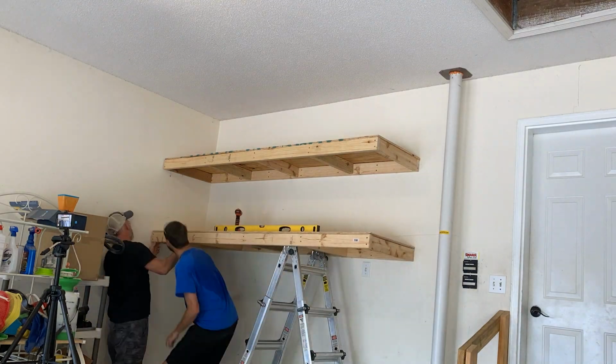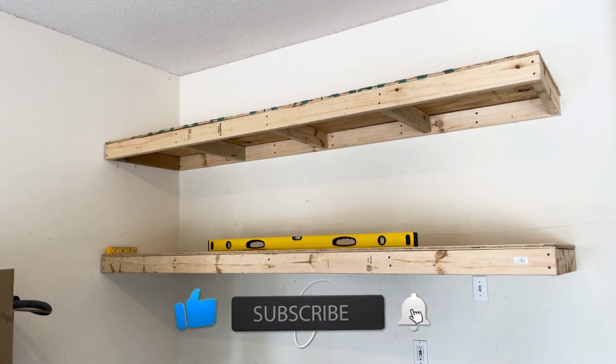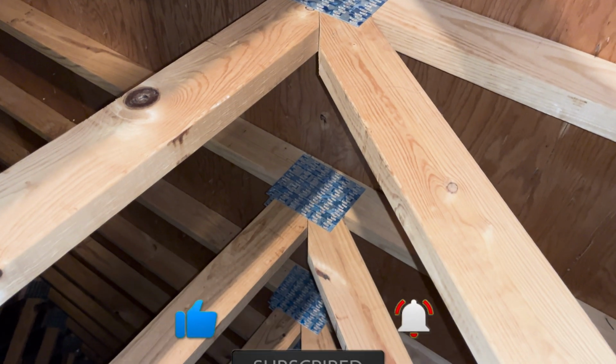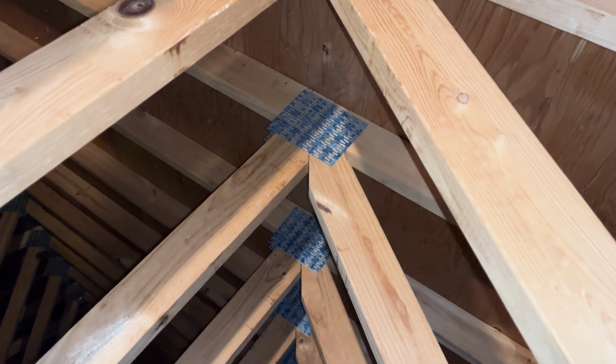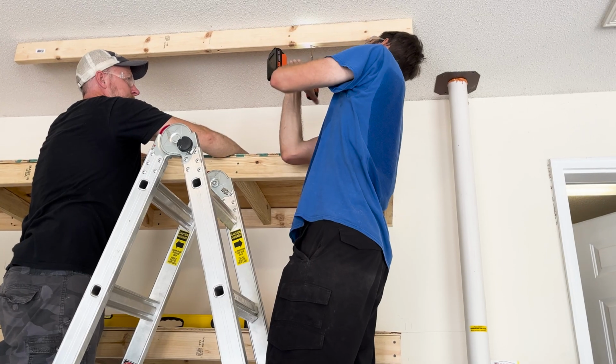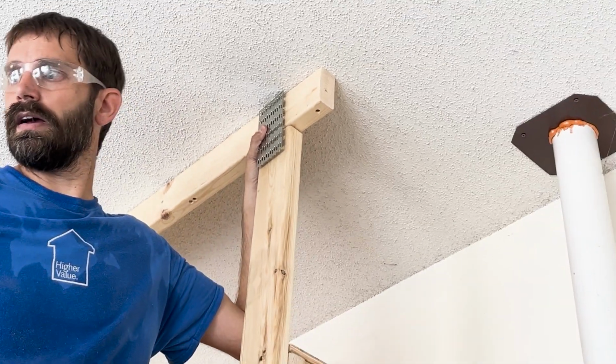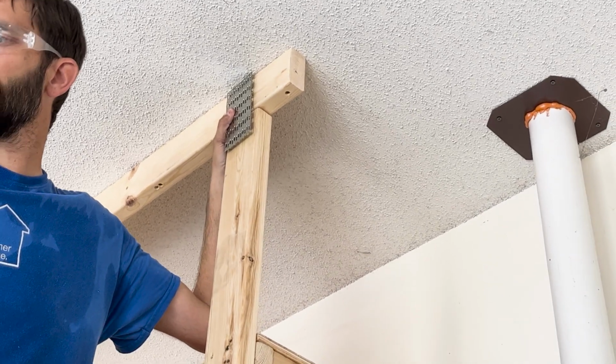Now, the shelves are somewhat heavy, but they'll hold in this position just fine until we get them connected to the ceiling. John drew inspiration from the way roof truss systems are built while designing his approach for anchoring these shelves to the ceiling for maximum strength. A 2x4 buddy board will be positioned against the ceiling on its side, and a pair of 2x4s will drop from this buddy board down to the shelves and fastened.